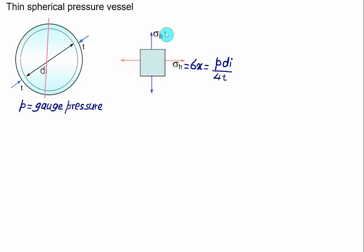The stress along the y-direction σy is equal to the hoop stress: σy = P × di / (4t). Both stresses are equal circumferential stresses. The stress acting along the third direction (z) is equal to zero, and on both planes the shear stress is also zero.